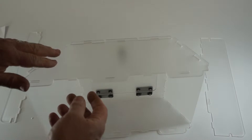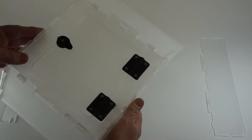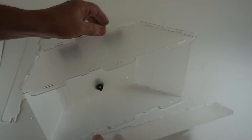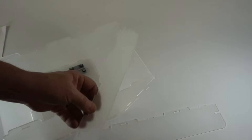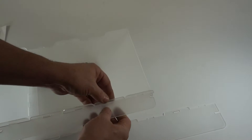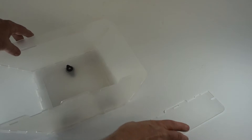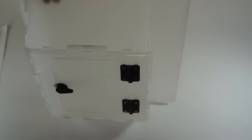You don't want to force them but they'll go together with a nice clicking sound. As we added the sides the enclosure becomes much more rigid and now we just have to add the two inserts for the left and right side frame inserts. We'll start with the small insert — large slot to the bottom, small slot to the top — and start at one end with a gentle bending motion, just engage each tab, then reverse it and take the right-hand side insert, small tab to the bottom, large slot to the top, and just engage the tabs one at a time. That simply, we've built the front of our enclosure.